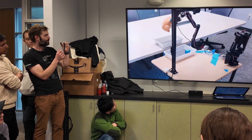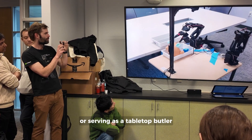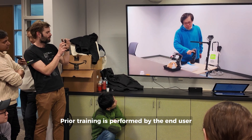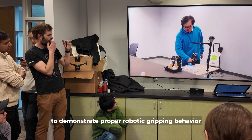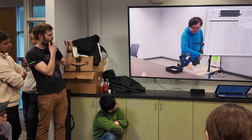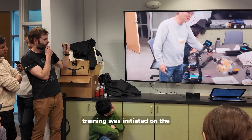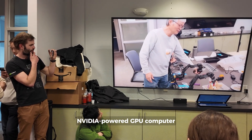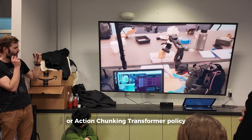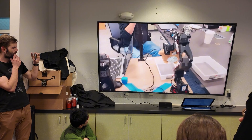Use cases include assisting disabled users with medication retrieval or serving as a tabletop butler in busy work environments. Prior training is performed by the end user on various objects to demonstrate proper robotic lifting behavior. After dozens of samples, training was initiated on the NVIDIA-powered GPU computer using the ACT — Action Chunking Transformer — policy, enabling the gripper to dynamically locate objects at the closest table or workbench surface and move them onto the robot.